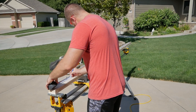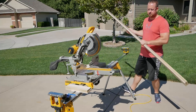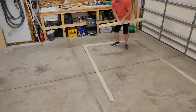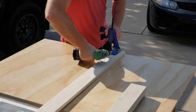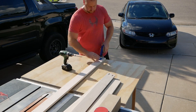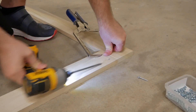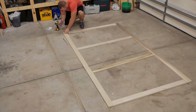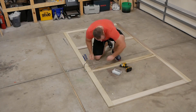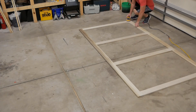Now that's out of the way, on to actually building the frame. For the wood, I went with 1x4 poplar boards. The top and bottom were cut to the exact width, and the sides and center support were all cut 7 inches short of my total height to account for the top and bottom boards. Using a Kreg jig, I put two holes in both ends of the shorter boards and started assembling the frame. It's important to make sure the boards are flush during this process so the outline of the board doesn't show through your screen. To make sure there are no rough edges, it's not a bad idea to flip the frame over and go over the seams with a sander.